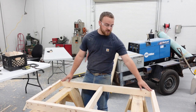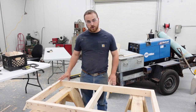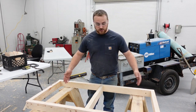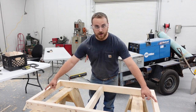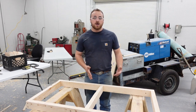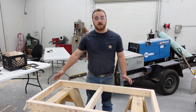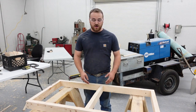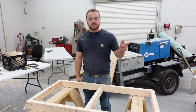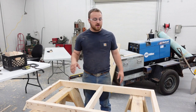I've already gone through and double-checked all of our surfaces on our top piece. I'll take the glue, put a thin layer on all of the frame piece, take the top, set it on top, and then when I start screwing, I want to work from the center out. I'll put the center screw in the top and the bottom, and then work from the inside out. What that helps is it keeps any bows from developing in the process. You can do it from the corner, or work from the middle out — it really just depends on how you like to do it. In my personal preference, I like to work from the center and move outwards, as I feel that gives me the best result. Another thing to keep handy is a damp rag — I have a bucket of water and just a cloth that I keep out here.